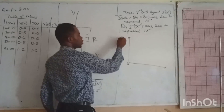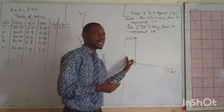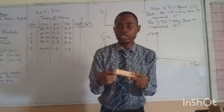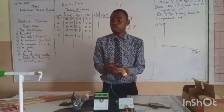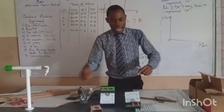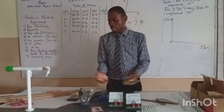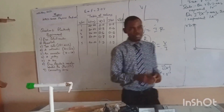You plot your graph with your origin. On the vertical axis you have V-inverse, and on the horizontal axis you have I-inverse (ampere-inverse). You plot your graph. If you need the intercept, you bring out the intercept on the vertical axis, and from there you are good. After that, you write your precautions. To write precautions is very simple. Since I was using a battery, there was a precaution about the battery: I ensured I disconnected the battery when it was not in use — to avoid the battery running down. I was also using a voltmeter and ammeter, so definitely you know about the issue of parallax zero error when taking measurements on the voltmeter and ammeter. All those things you need to put in. Now I want you to plot this graph and submit to me. Thank you.